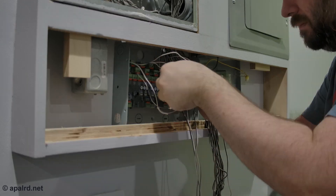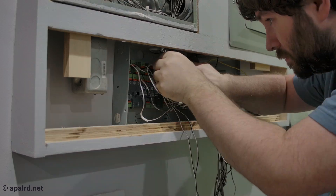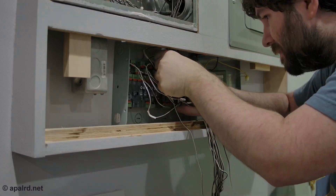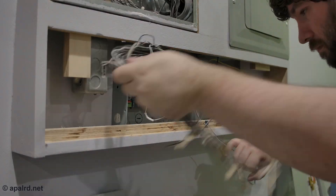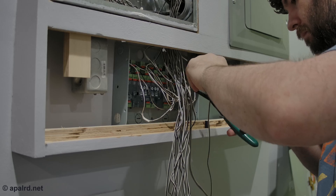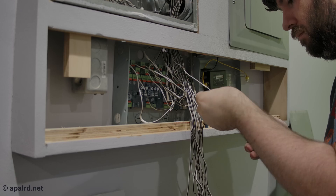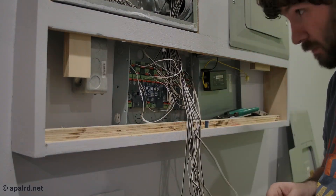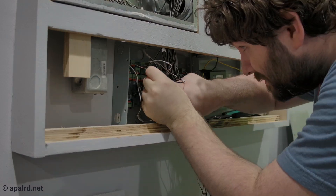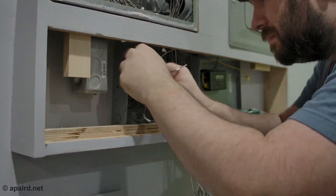I decided to power it by PoE, so I bought a PoE splitter. It takes power over ethernet from my switch, splits that out into 5 volts for the device itself and ethernet for the device, and I get 12 volts from the transformer that it uses to measure voltage. This way I can know for certain the power has gone out because the voltage measurement drops to zero, but the unit doesn't disconnect. The monitor itself has a serial port that outputs data regularly, and you can get modules that send that data different places. I went with the Wi-Fi module — even though I want wired ethernet — because the Wi-Fi module converts the byte stream to JSON. You can give it a URL and it'll do an HTTP request every five seconds with the new data, or you could query it periodically.